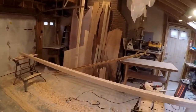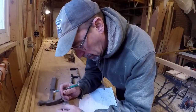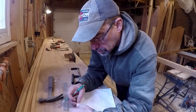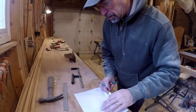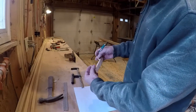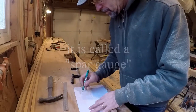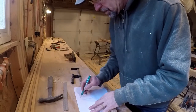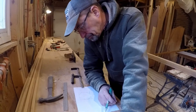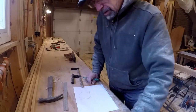All right, I've got a tapered square mast. So the next step — and this I learned from a guy, I'll put his name on the video, I can't remember it off the top of my head — but there's a wonderful set of YouTube videos on building a 14-foot traditional sailboat called the Mayflower, and he has a section on a tapered round spar. He turned me on to this device. The beauty of it is whether it's at an angle or not, it's going to scribe the marks you need to turn a square into an octagon. The principle is that rather than trying to hand-round something, if you can get flat surfaces and approximate the curve as best you can with flat surfaces, you're going to get a more uniform result.